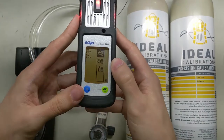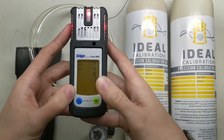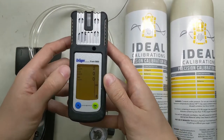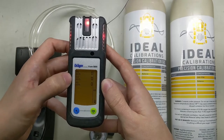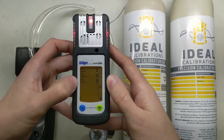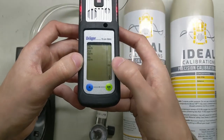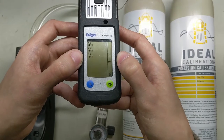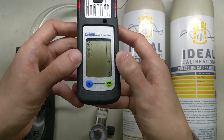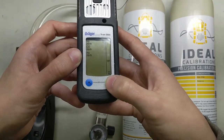The first thing we want to do is zero this unit, so we're going to hit OK. You can see it shows all the sensor channels are 0. You'll notice there's an extra one here: H2, then CO, then H2. What's going on there is there's an extra sensor within the CO sensor that actually detects hydrogen and cancels it out from the monitor so it doesn't interfere with the CO reading. Let's acknowledge that and confirm it's good on zero.